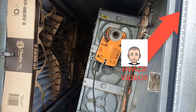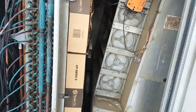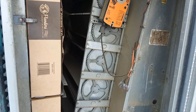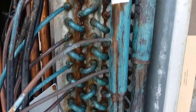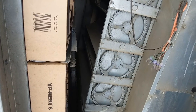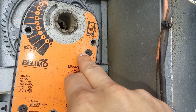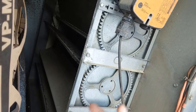That is amazing that even worked. I have to give a shout out to HVACR Videos. If you don't watch his channel - he showed me something on a whole different unit, I think it was a Lennox unit. And I was like, you know what? Our dampers are wide open and it's a 90-degree day. It's just sucking heat and drying out this coil. But this coil is now sweated back so beautifully. Just watching one of his videos on the Lennox repair that he did, I figured I'd come up here and give it a try. It was set right here at 0.6. I just turned this to zero - that closed the upper return. This will also save us on a lot of filters.